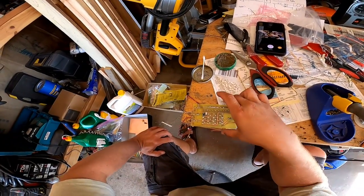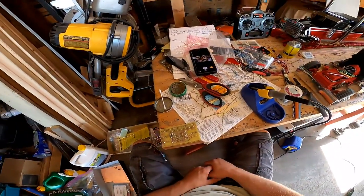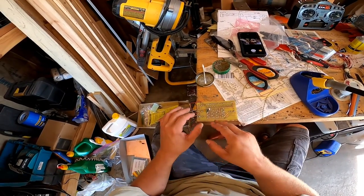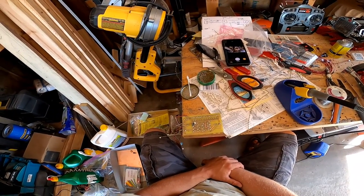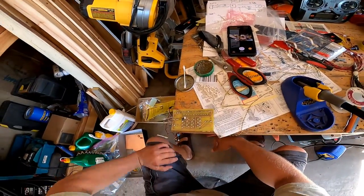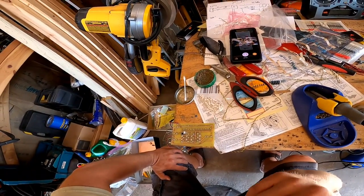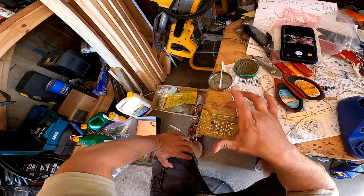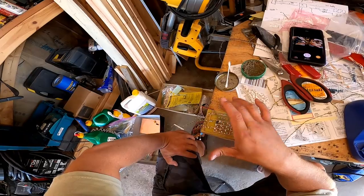All right, so I've decided I'm not gonna solder anything more onto here until I get those resistors, or until I get the resistors and my relays. And the reason is because I just tested across the coils on that, and I was getting 360 ohms resistance when it's closed, which means it's the same as one of these. So really when I get these new relays, I don't know what they're gonna be and what they're going to do.